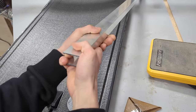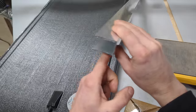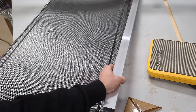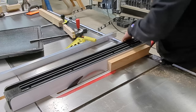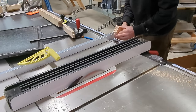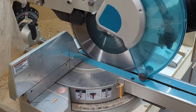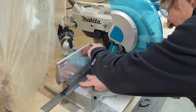Let's talk about the brackets I plan to make. I purchased this aluminum C-channel — about an inch and a half by one inch — and the plan is to cut off about half of one leg so that when it's mounted to the panel it can rest on the flat portion. I'll put a couple of rivet nuts in each one, with bolts coming through from the other side. I've got to make 16 brackets total — four four-inch-long brackets per panel. To batch out all 16 consistently, I'm going to make a few little jigs to make the process nice and repeatable.